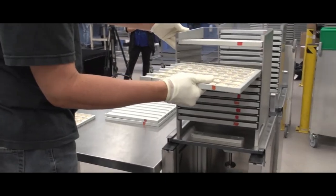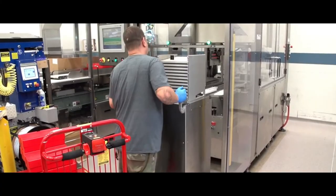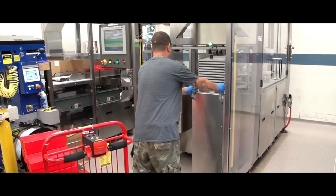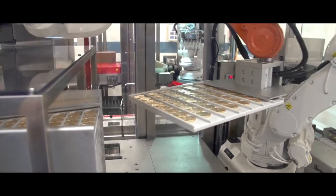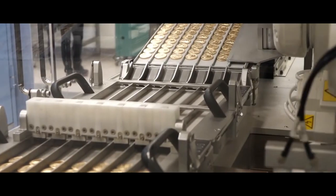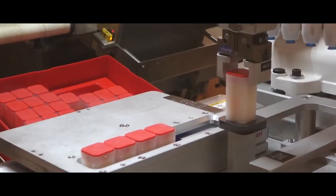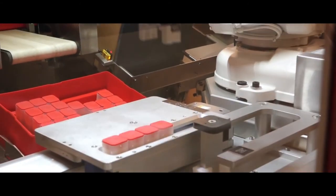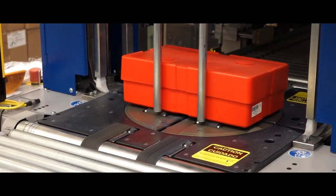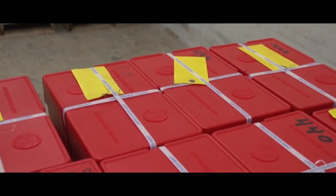The prolific Jean Warin, one of the great engravers, finally established the use of the fly press — a variation on the screw press in which the helix angle of the screw was much increased. The rotational arms ended in heavy weights that were swung with great velocity by two operators, working for only 20 minutes in each hour, and the elasticity of the system caused a rebound of the arm to its original position after the coin had been struck. Again, with a team of moneyers, a rate of production of a coin every second or so could be achieved.